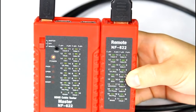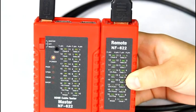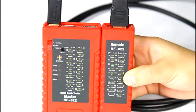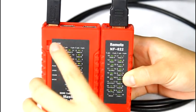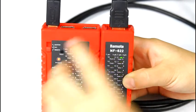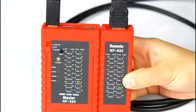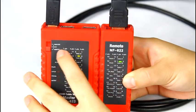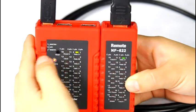There are three modes to test. First time pressing the test button, we can see the LEDs light up one time. Second time pressing the test button within 2 seconds, we can see the LEDs light up one by one. The third time pressing the test button within 2 seconds, we can turn on the manual testing mode.